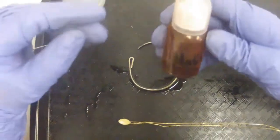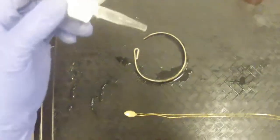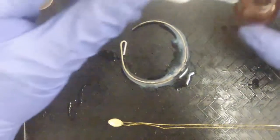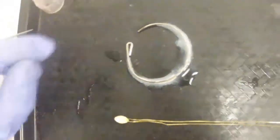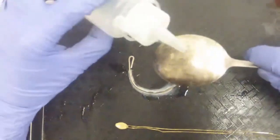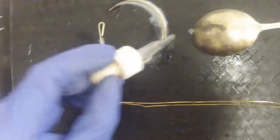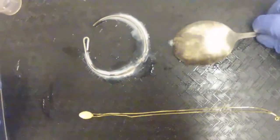So then we take a sodium chloride solution — which is just a fancy way of saying salt water. And once the salt water hits the silver nitrate, there's a chemical reaction that happens. You can see it's all turning white. That's because the silver nitrate and the sodium chloride combine and create silver chloride. So that's how we know that it's solid silver. On these other spoons that we tested, this is the reason we put a grind spot. If you put a little drop of acid on there, you can see the plating is very thin — it's already starting to turn green. But if we put the salt water on it, it'll still create a little bit of silver chloride. So that's why we put a nice big grind spot on there, just so we can get a better idea of what's going on.